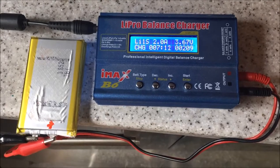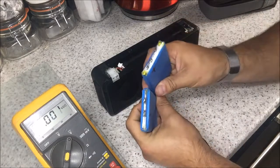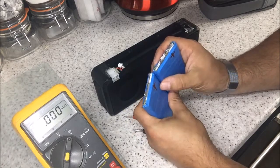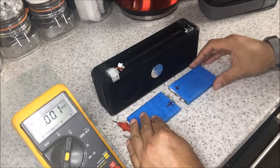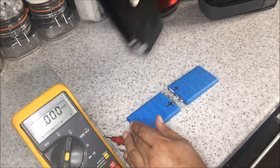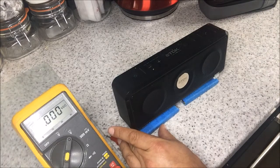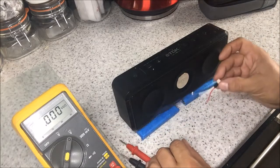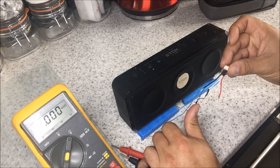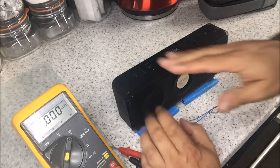They're looking positive. Let's see how we do. So I've made two battery packs — here they are, both two sets of lithium-ion cells. I've marked up the plus side, positive side. These very carefully need to be fitted with some insulation between them, and they will live underneath the speaker. Here's a cable that I've bodged together — positive, a thermistor to detect if things are going over temperature, and negative. Just got to wire these up and then we can fit them.